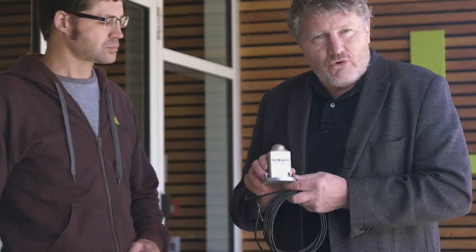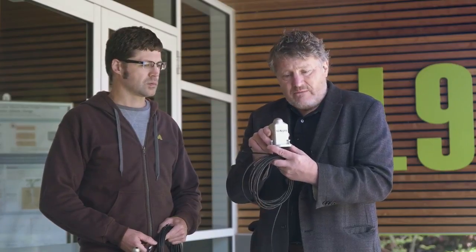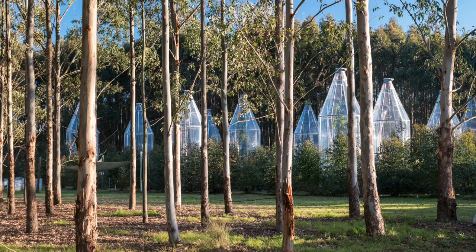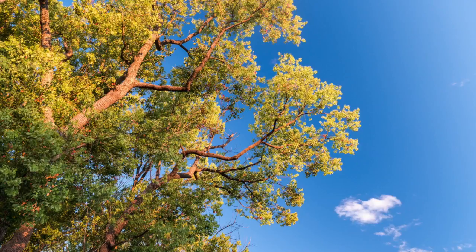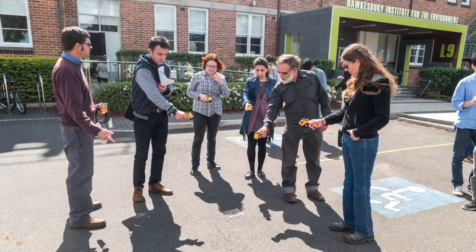One of them is a spectral radiometer — it's small, compact, and rugged, made for continuous monitoring outside. Like any spectroradiometer, it can be mounted facing up, and a second one can be mounted facing down so you get reflectance signatures from plant canopies. It's small and lightweight, so it can be flown on a drone. We've been working on this for several years, and tomorrow the videos will show in detail the characteristics of this sensor and its applications.